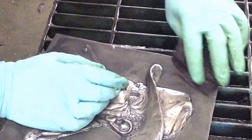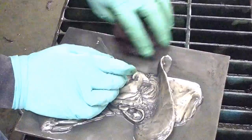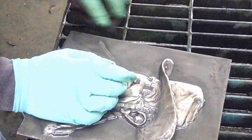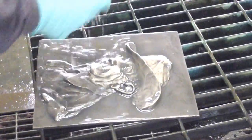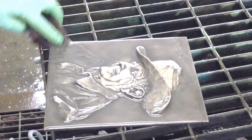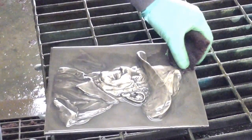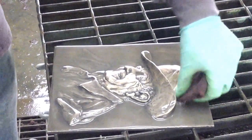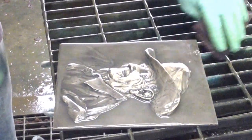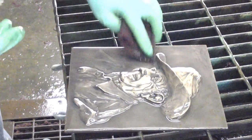So what are you thinking for the color that goes over this? Well, for the traditional approach, usually what goes on top of this is ferric nitrate, which is the most traditional color combination. So sulfur and ferric nitrate make that traditional brown. And you can always play with it, controlling it if you want it lighter or darker brown.